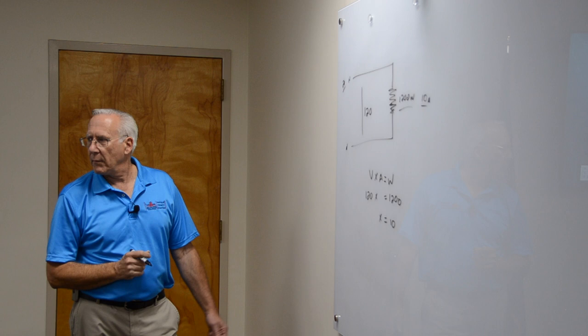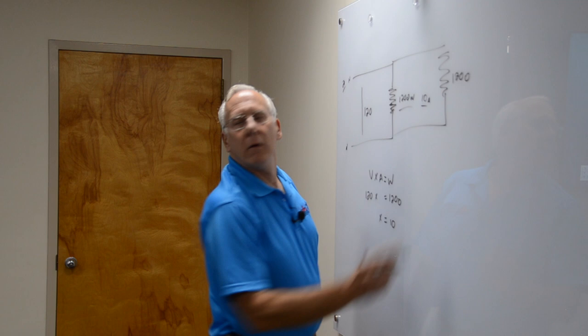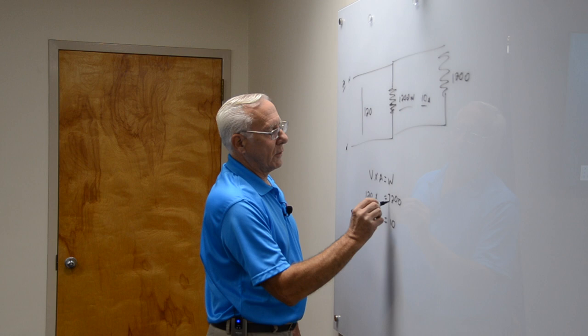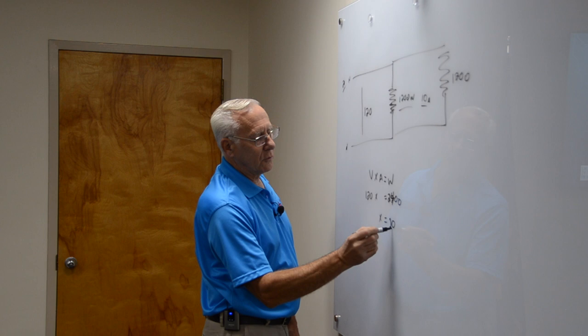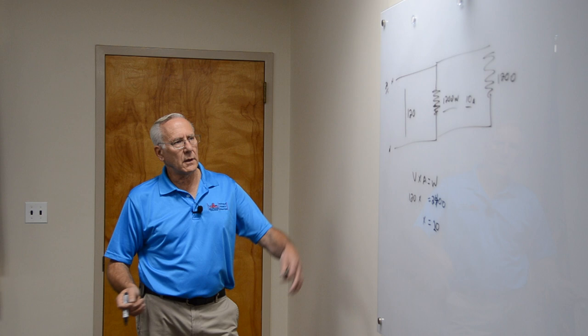And then they come along and they plug another one in. Okay, now what do we got? How many watts do we have now? 2400. 2400 watts at 120 volts. Do the math. What do we come up with here? 20. What's going to happen to the breaker? We trip it. Don't we see that all the time with these fry pans and these coffee pots when the teachers come in and they do all this stuff and the parents come in and they blow everything?